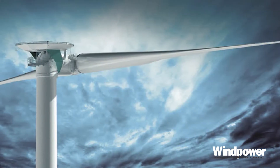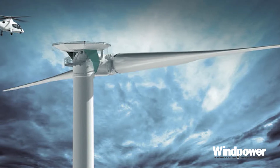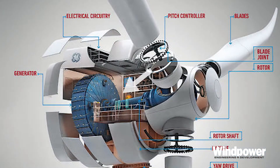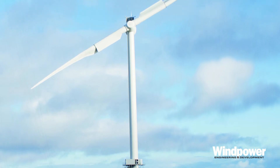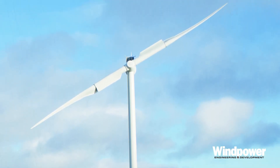So you've probably heard about direct drive turbines. They're so-called because they have no gearbox, and the reason for getting rid of the gearbox is that it's been a trouble-prone unit. In direct drive turbines, the main shaft directly connects the rotor to the generator — a permanent magnet, or so-called PM generator. In this design, powerful magnets produce magnetic fields, and spinning the copper coils through the magnetic fields generates electric current. Now you may ask, if this setup gets rid of the gearbox, why aren't all turbines equipped with permanent magnet generators?